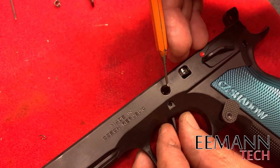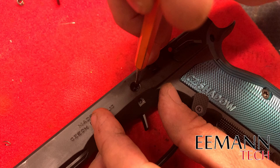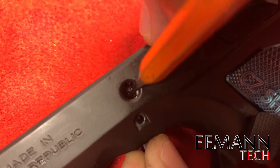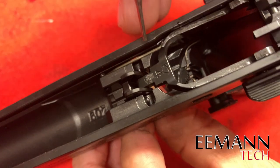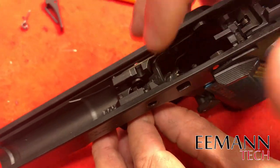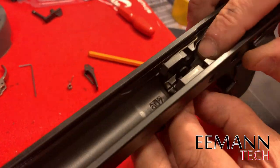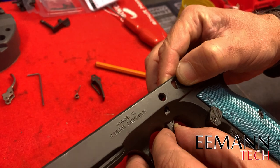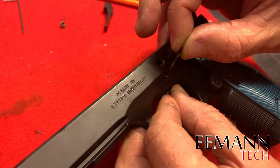It's a little bit magnetic — there we go, and she's in. Just make sure it doesn't come back out. From this side we can see it needs to go more to the left so it's centered, and that allows our trigger to move up and down. The trigger is now attached to the trigger bar. Now we're going to push the trigger bar down against the pressure of the trigger lifter spring to line up the hole for the trigger pin.